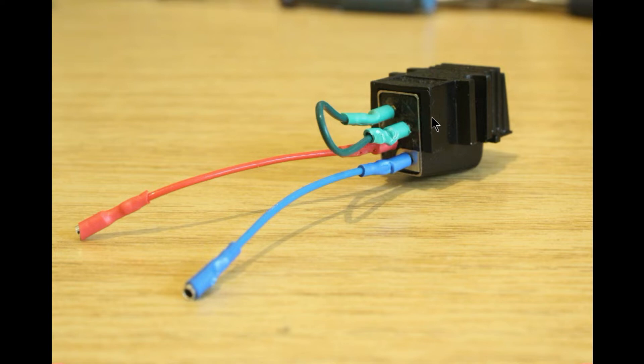Here we are with the cartridge the right way up — that's the top. Left and right are connected together with the green lead. That leaves the left ground and right ground, and that's where our signal comes from. The red one is the left ground, and the right ground — the one with the metal strip — is actually going to be our overall ground. So we've got one signal: positive and negative. Now we can put the cartridge in a head shell.